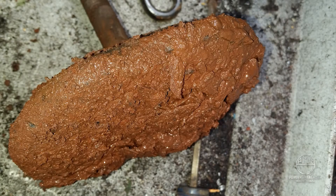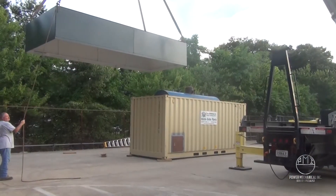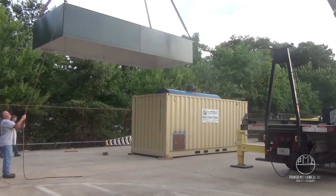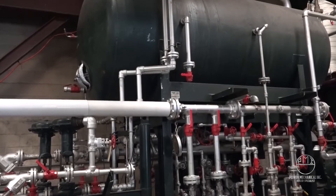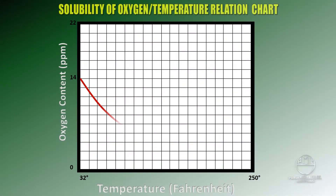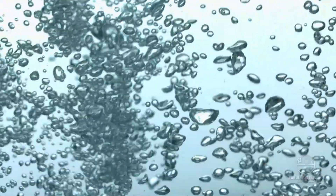Dissolved oxygen present in the feed water can cause rapid corrosion in boiler tubes and other metal surfaces within the vessel. While there are many designs, configurations, and added features of de-aerators, the primary design types are spray type and tray type. All systems operate on the same principle: the solubility of dissolved gases in a solution decreases as the temperature of the solution increases. In short, introducing the feed water to a steam-laden environment forces a large majority of the dissolved gases to be released.